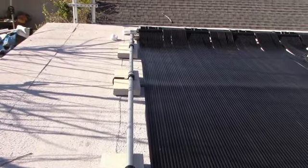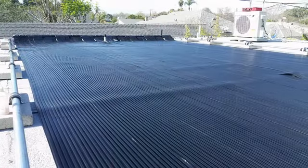Hi, I'm Mike from EcoSolar. Here I am stopping mid construction, wanted to show you a flat roof system. It dawned on me about eight years ago, I used to use a different style product — used wood, insufficient building materials, didn't like how it all went together. I searched for the solution and I found Hot Sun on the internet. I reached out to Ken Wright, the owner. He explained to me the right way to do it, and it's right here in front of you: a ballasted flat roof system, no penetrations, all building materials that are meant to be outdoors — nothing that's going to rot and fall apart in a few years.